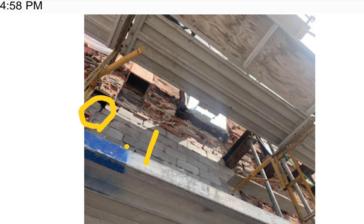And then we see the brick. This brick is not even pushed back in. So when they put their face brick on this one, they'll have to be further out to accommodate for things like that. Or they take a chipping hammer and knock that face off. And that counts. That's the load path of the structural wall. Incidentally, this is not supported. It's supported over here, here and here. This is supported here, but this out here, unsupported.